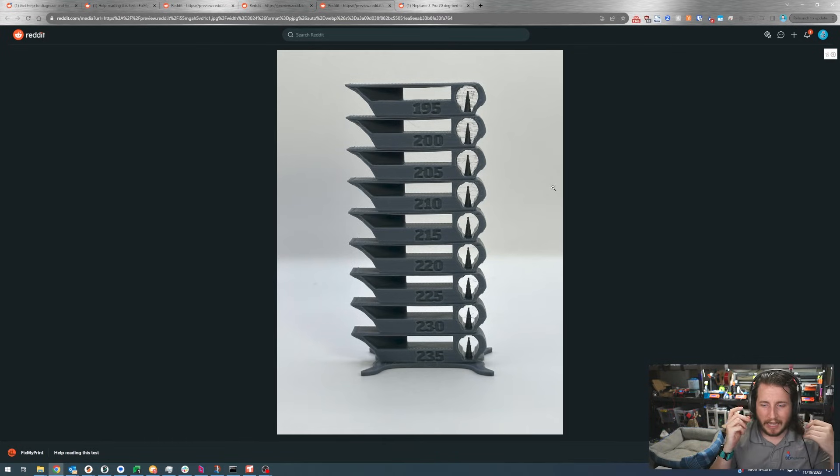I would love to know your thoughts on temperature towers in the comments. We don't often get really good photos, so I wanted to do a specific episode on temperature towers because they're so incredibly important. With a little experience you can look at a material, know its base filament properties, estimate the right temperature range, and adjust on the fly. If you forget, have a small print failure, and know it's temperature-related, just crank the temp up 10°C and send it.